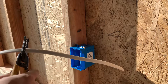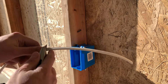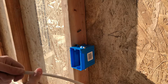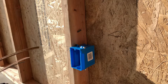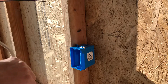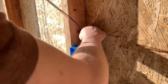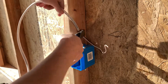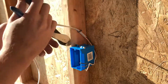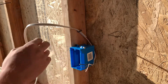So I'll just make it like a one-foot pigtail. I'm gonna cut that and then strip this back right here. And like I said yesterday, you can either strip your wires before you put it in the box or after — it really just depends on what you like. So I have my two sets of wires right here, and I'm going to try to stick this through the staple from yesterday. I'm using my angled-head diagonal cutters to pull that staple out a little bit, because you can put two Romex wires under one staple.